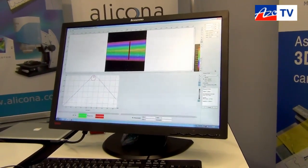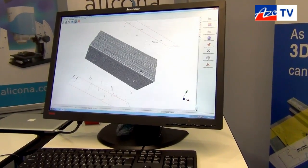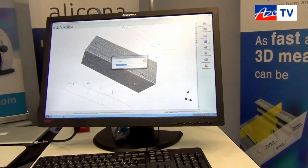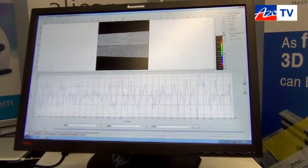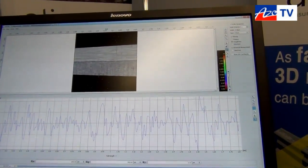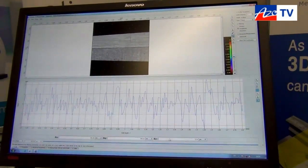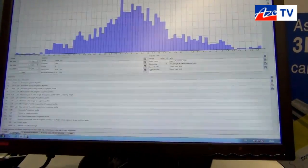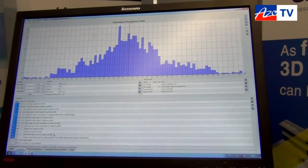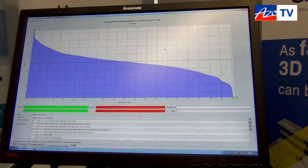Using this technology we can readily measure profile but we can also measure surface finish. If we choose profile roughness measurement, the software automatically draws a line across the uppermost position, and you can see we're measuring Ra, Rq, Rz, and all the remaining roughness parameters available from this measurement. We can also go from there to a bearing area curve.